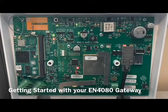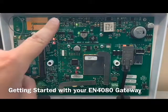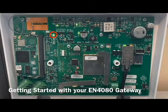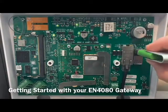To start, we will pull your configuration files off the gateway with a USB thumb drive. Begin by pressing the reset button in the top left hand corner. You will wait for the green power LED to start blinking. When the LED begins to blink, you can plug in your USB flash drive into either USB port available.